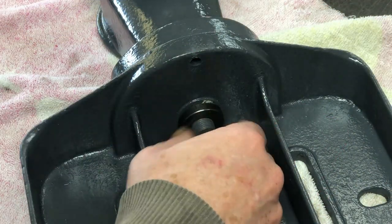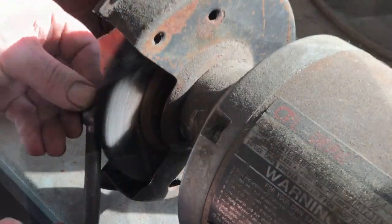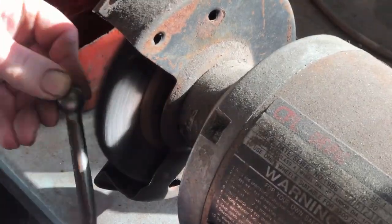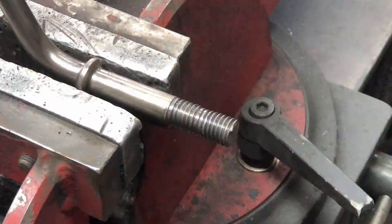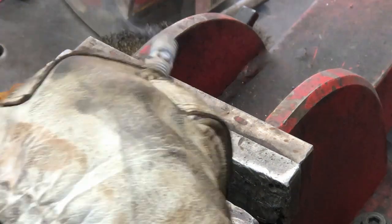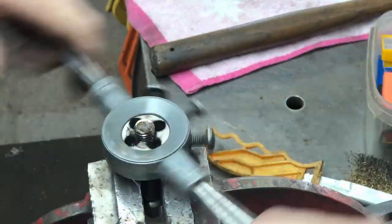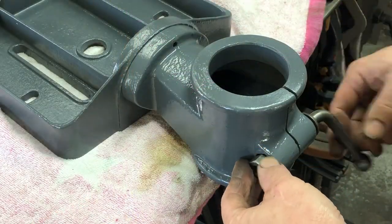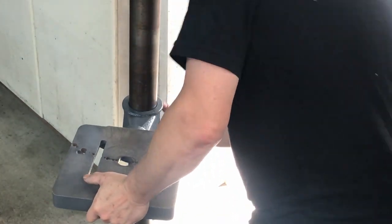Here I'm assembling the table onto the clamp for the pillar. I'm cleaning up the clamping handle and I discover that the threads on here are stripped out in the middle, so I build them up with a bit of weld. I grind that down and come back with the die and cut the thread back in. Now that all works quite good. The table is put onto the pillar and clamped in place and that's pretty solid.